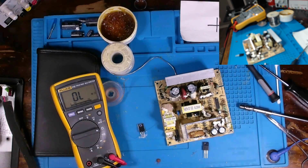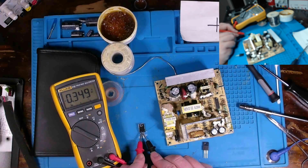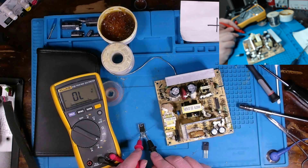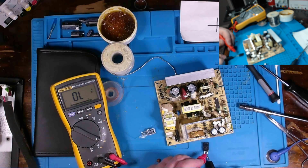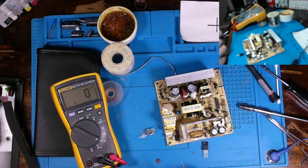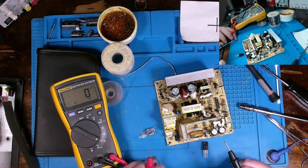Testing our components out of circuit, and the old rectifier out of circuit, doing perfectly fine. The voltage drop is slightly different compared to the component we'll replace it with. Additionally, and I misspoke in the past, this is a 1 nanofarad capacitor, but it's not 50 volts, 1K. I'm still measuring 1 nanofarad, despite the burn mark underneath it. Again, we're going to replace both of them.